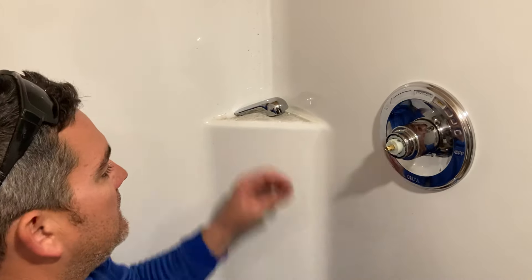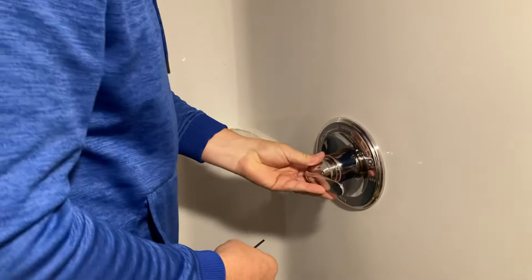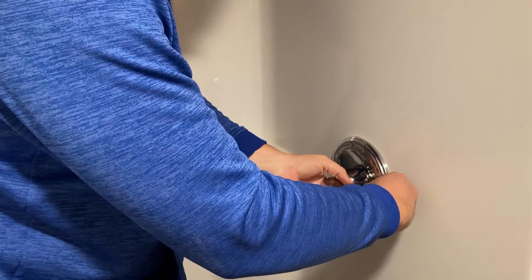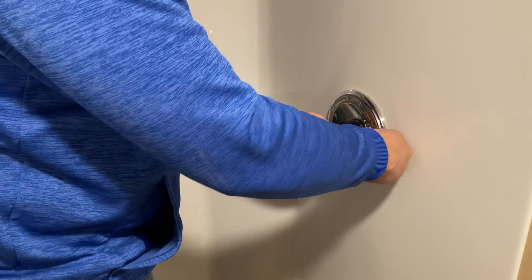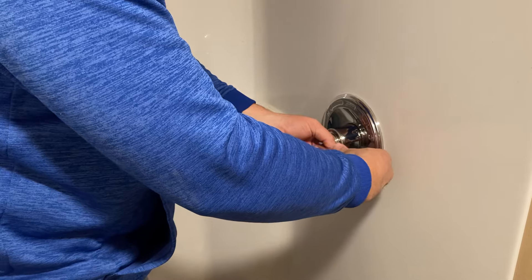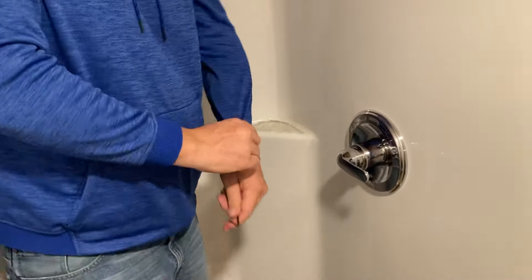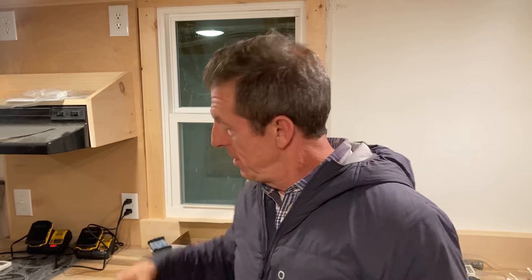And that's it — all you need is that number three allen to get the handle off. Put that back on, snug it back up, and you're done. Not much to it — really simple. These new ones are even more simple than the older ones; the older ones you need a screwdriver. You don't have to take the trim kit off or anything. Thanks Tom! Hope this helps you out if you've got a problem with your shower. We hope to bring you more videos to help you understand maintaining and taking care of your homes. Have a great night — we'll see you tomorrow!